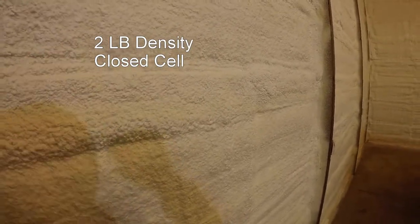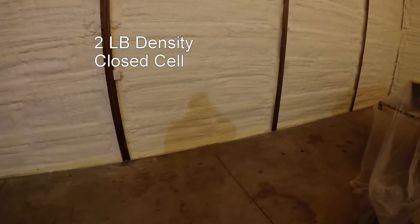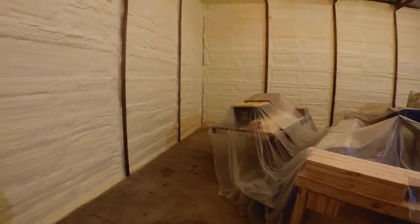One of the first things I'll point out is I had them come in and start on some spray foam on the walls here. I got roughly two inches of spray foam — about R16 on the wall. The reason I went with spray foam was for an airtight seal. There was Tyvek on the outside of the studs on the backside of the steel. There are some mouse holes back there and I really wanted to keep the critters out, as well as be more energy efficient.